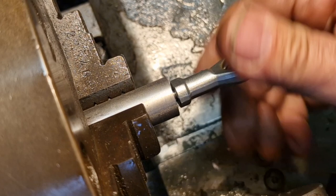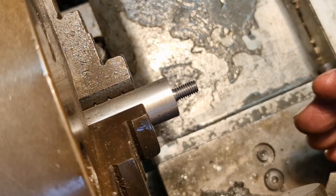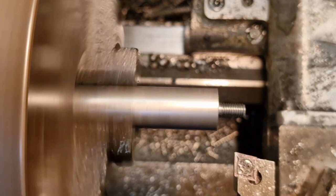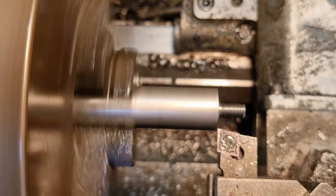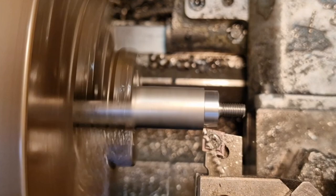So now we can have this out more, because we need 30 millimeters this way down to 16 millimeters. So. What do we want? 16 mil. All right, and we can do that in one pass. Here we go, which is there. Scream if you want to go faster. Bit of a squeal up, but not too shabby.